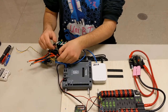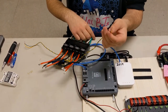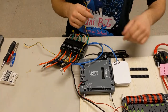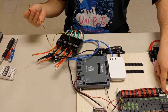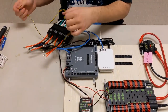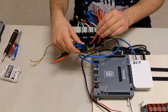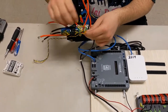And as I said before, you have your power, you have the ones connected to your motor, and then you have the CAN bus. The way the CAN bus works is that it connects all your motor controllers in one line. And from that, as you can see, there are two ends. One end connects to the power distribution board to provide power. The other one connects to your roboRIO to get controlled. We just bundled everything up to keep it a little more compact. We could probably do a better job, but